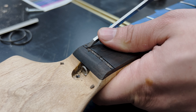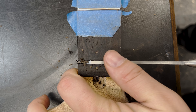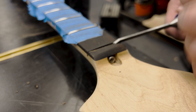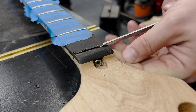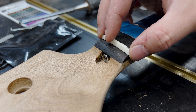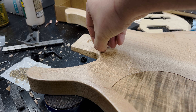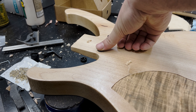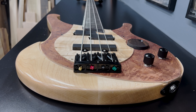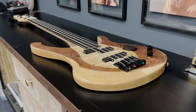If you've ever wondered why 1/8-inch chisels are made, this is why — creating a clean mortise for the nut was one of the final steps needed to complete the neck, although they are extremely annoying to sharpen and control due to their small size. The nut was super glued into place and the final hardware was added for completion. String trees and neck ferrules are all that's necessary for bolt-on necks such as this. Overall, this bass turned out to be one of a kind. If you enjoyed watching and learning, please like and subscribe so we can continue bringing these videos to you. Thanks for watching and happy building!